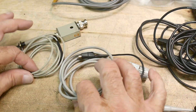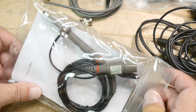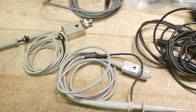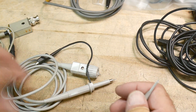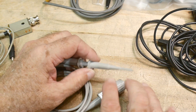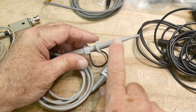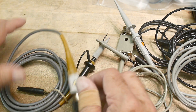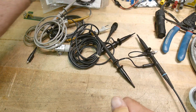If you're looking for scope probes, you can buy brand new ones from China cheaply, but they're not great quality. I think you get better quality if you get brand-name ones. You can look for used ones - if you shop around, make sure the little hook comes with it. A lot of times people list them missing this part, and it's hard to replace if you lose it. There's also a super old one here with a pin on it. If you do get an oscilloscope, the probes will often come with accessories.